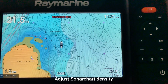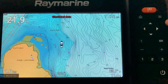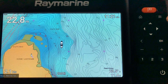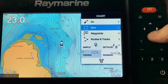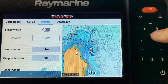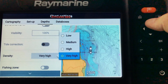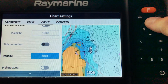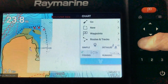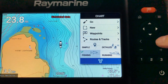Within fishing mode showing the Navionics Sonar Chart, you can change the density of the contours. If you're in an area with very steep banks, the contours can stack up and appear quite dark. In the settings menu, go to depths, and you'll find the density setting. You can change from very high to high, and you can see in the preview on the right hand side that it's changing the density of the Sonar Charts. Going back to the chart, you'll see fewer contours. Changing it back to very high again will show more contours.